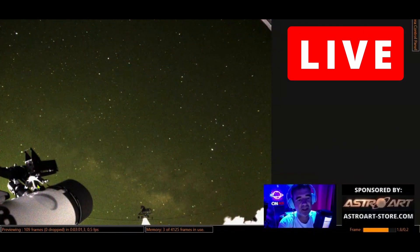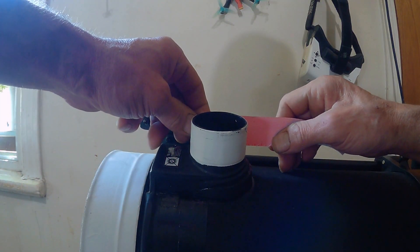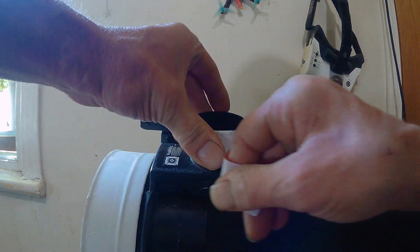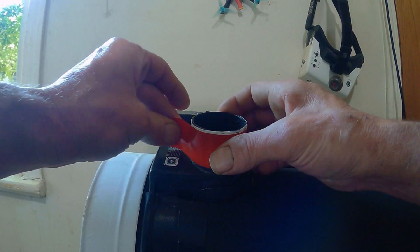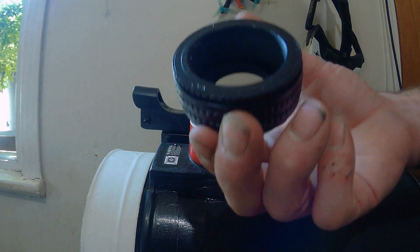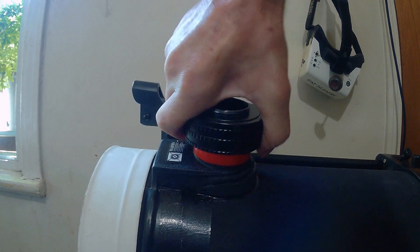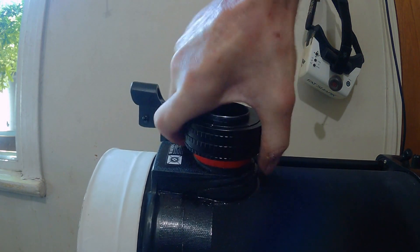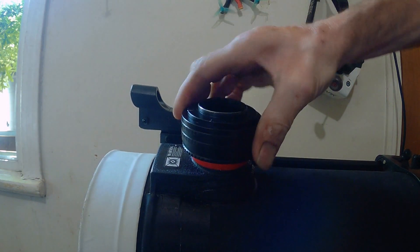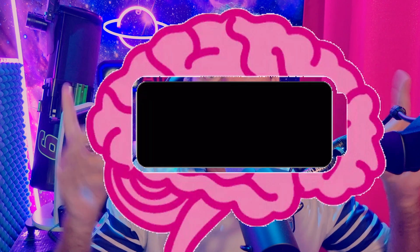But during one of our live streams, one of our channel members, Fred Lead, showed us on camera a nice solution. It looks good, but he had a problem and I gave him my opinion. The fact that it's sustained by contact between the new focuser and the old one by tape is not very reliable to me, because we all know what happens with tape — with temperature variations and with time, it bends, it deforms, and it might introduce tilt into the focuser. But I'm glad he did it because it triggered in my brain a new idea.